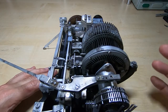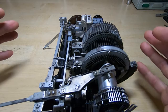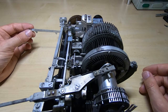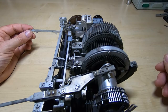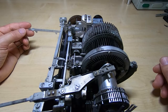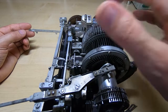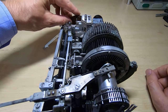These are all being driven from the same motor, so they all rotate continuously and the mechanism is used in a critically timed manner to perform the various tasks. These actually occur at a relatively high rate considering this is a mechanical machine. What we're doing here is effectively feeding a series of zeros and ones into this mechanism through this linkage — this is normally connected to the solenoid. The solenoid receives zeros and ones from the sending machine, and that determines whether the particular part of the cycle will see a zero or a one. There are five data bits per cycle, plus the usual start-stop bits — akin to a serial communications system.